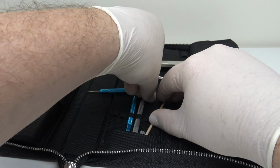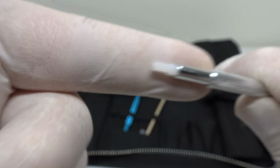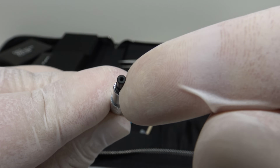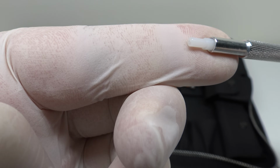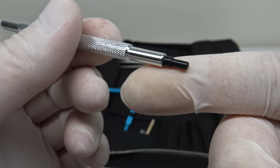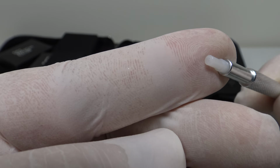They're very effective. One also gets this hand setting tool. So there are two plastic holes. This is for the minute hand and the second hand, and the other end is for the hour hand. So different size holes, one's black and one's white, so you can't mix them up. And I've used these myself. They're very easy to press on the hour, minute and then second hands onto the cannon pinion using the nylon plastic ends in these hand setting tools. One really can't go wrong because you can actually slide the end of the tool over the cannon pinion and press down the hand.